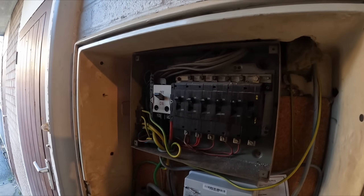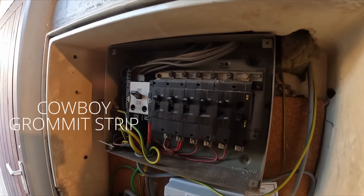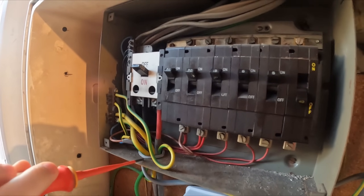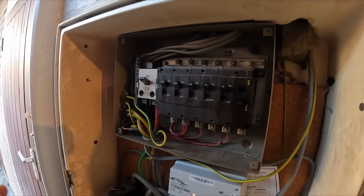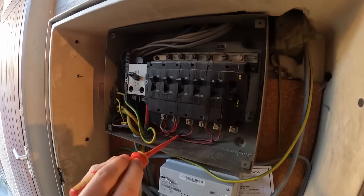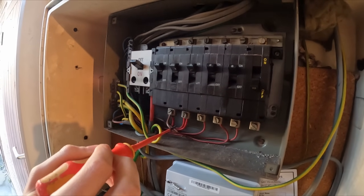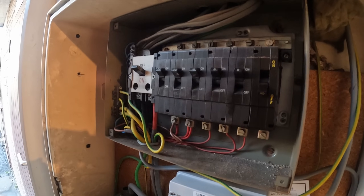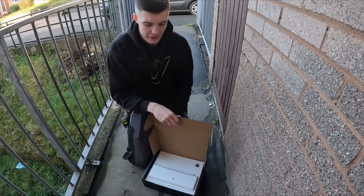So that's different to the one we saw the other day — all of the cables going in here. They've actually used cable as a grommet strip, just stripped it back. We've got smaller tails which we'll be upgrading from the isolator. We're putting in a bigger board. We've got one, two, three — a ring main. And there's a new circuit wired in that looks like someone's wired it into a cooker circuit, which is naughty — that's a new twin and earth cable.